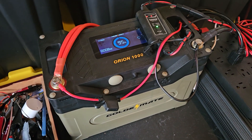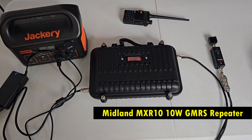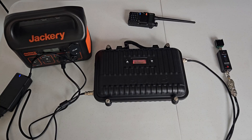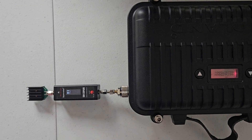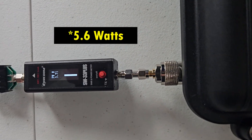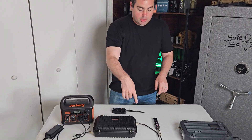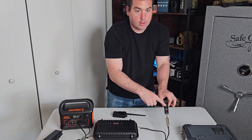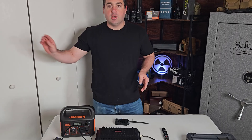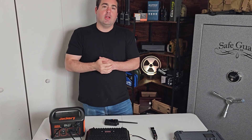This is why the upgrade to the Retevis is important, and this is sort of my problem with the Midland. It's a good repeater — it's just underpowered. This is a 10-watt repeater, but when you power test it right out of the antenna, once it runs through the duplexer, you're getting about 6.9 watts out of the end of it. What we're going to do is run a test through 30 feet of coax below the table. I have this running through a meter onto a power meter with a dummy load. I'm going to key it up and show you that this 10-watt repeater really turns into 2 or 3 watts. Once you run a coax cable up to an antenna, you are just getting a little pipsqueak of power out of a very tall antenna.